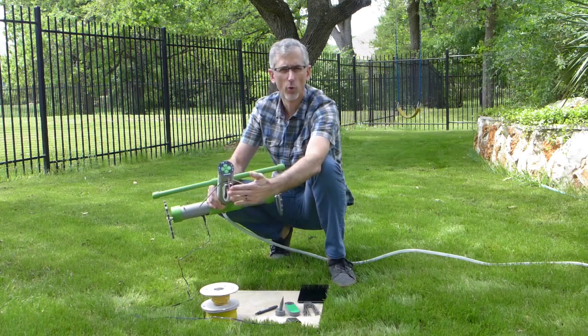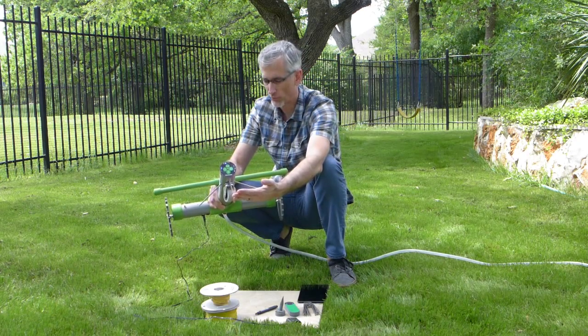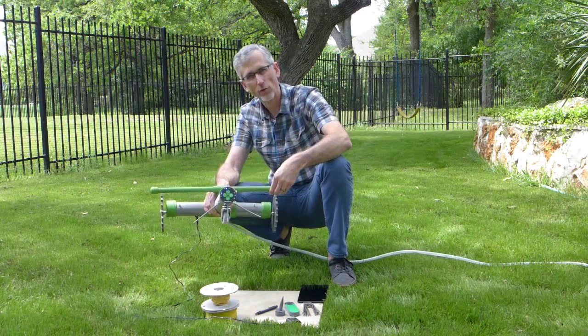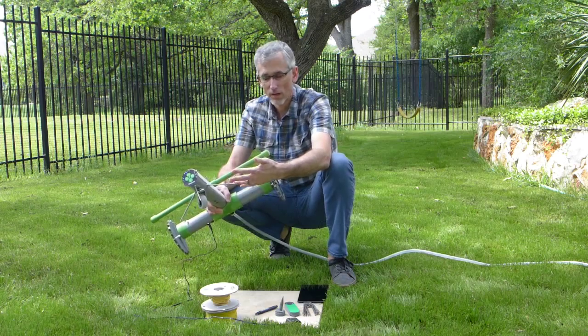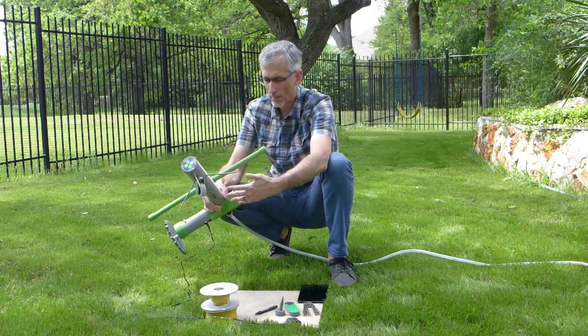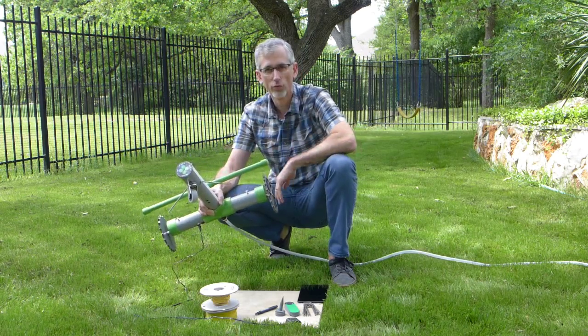On the front we've got some surface moisture sensors. These are used both for navigation and for grass moisture sensing. The irrigator bar on top is where the water comes out. And inside is the battery, a lot of electronics and sensors, a valve and flow control, and of course the motors.